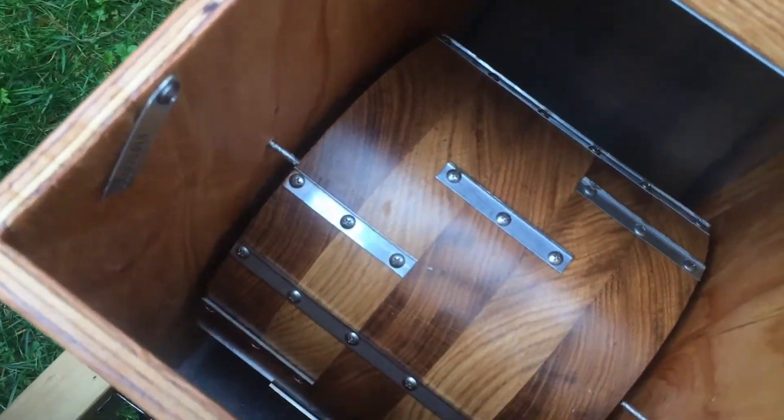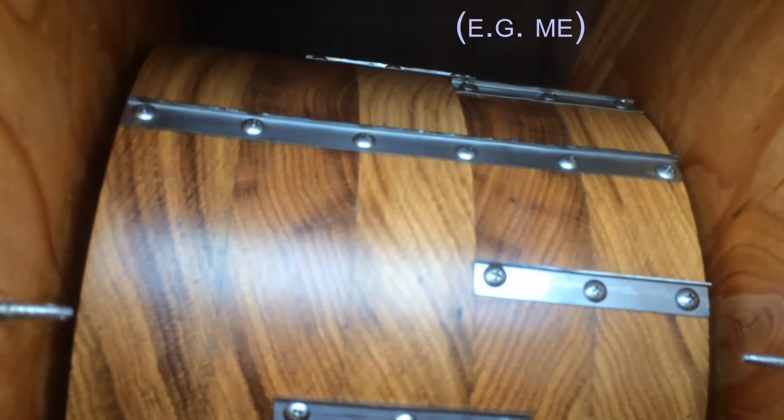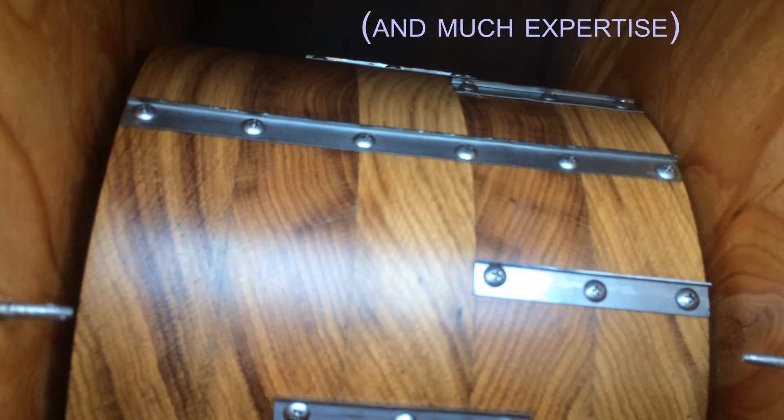The drum itself is five layers of white oak. If you don't have a lot of experience woodworking, turning a very precise drum like this is probably the hardest part of the project from a technical perspective. Once I had it roughly in shape, I put it on the frame, hooked up the motor, and turned it — then was able to sand it down to a smooth finish. You can use it as a kind of one-time lathe. A lot of folks just rough-cut the layers, glue it together, and then get a lathe tool and go across the front. I didn't need to do that because I had a friend with some nice tools, but as far as I know it works pretty well that way too.